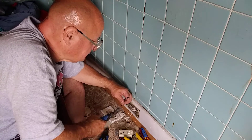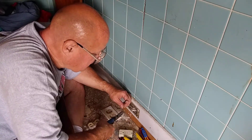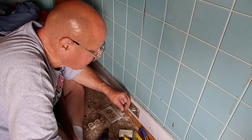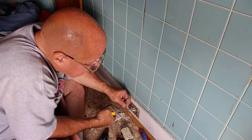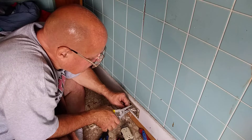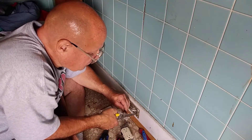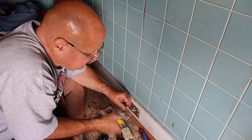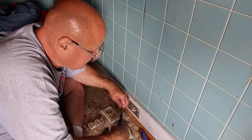It was not making very good contact, and there's some burnt insulation because of the poor connection. We'll strip these off a little bit newer so there's no insulation getting into the terminals, and clip them back a little bit.